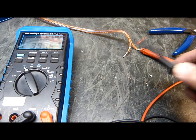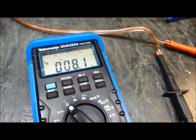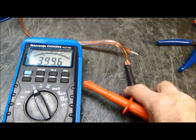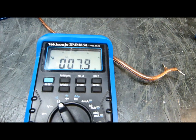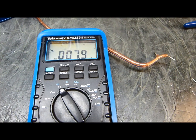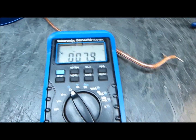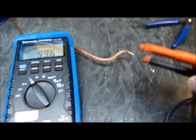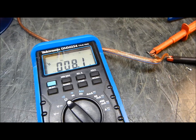Right now it's cold. When I measure across it, my meter reads 8.1 ohms. My precision resistors — high-dollar one-percenters — read 7.9 ohms on my meter. These are 300-watt one-percent low-inductance resistors; that one also reads 7.9. Back to our cold heating elements: 8.1 ohms. That's pretty good.